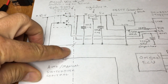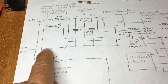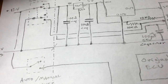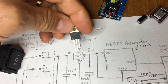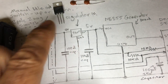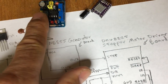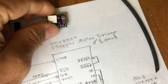We could have four wires - possibly even three - going between car interior and engine bay, since the ground wire could be shared. So we've got the two switches, a regulator that generates five volts - this is a LM2940 5-volt type regulator - and a couple of small capacitors. Then there's a pulse generator based on the NE555 chip on a little board costing a couple of pounds. You adjust it for frequency, which controls the speed at which the step motor steps.